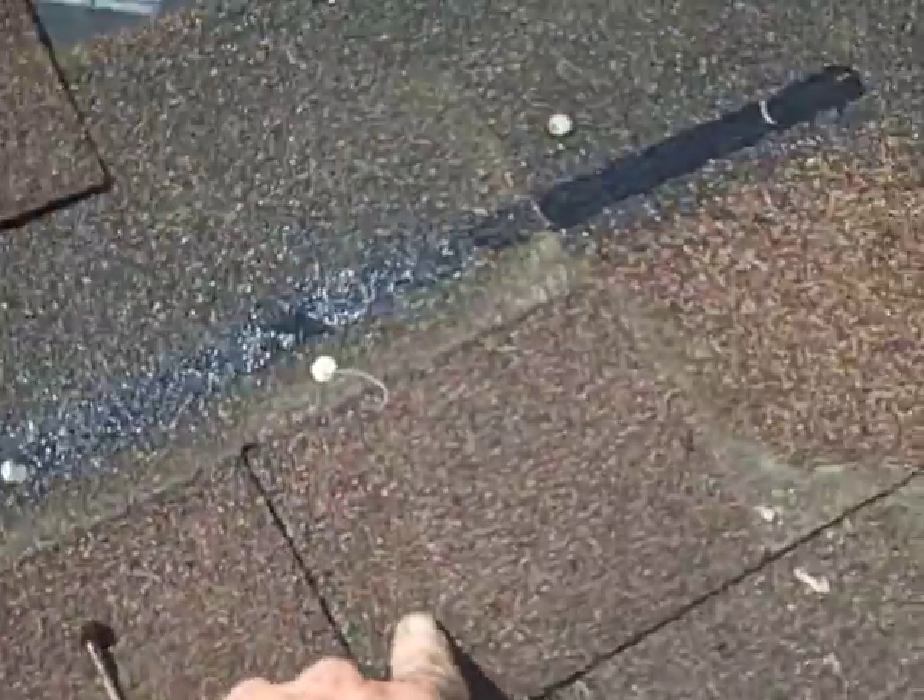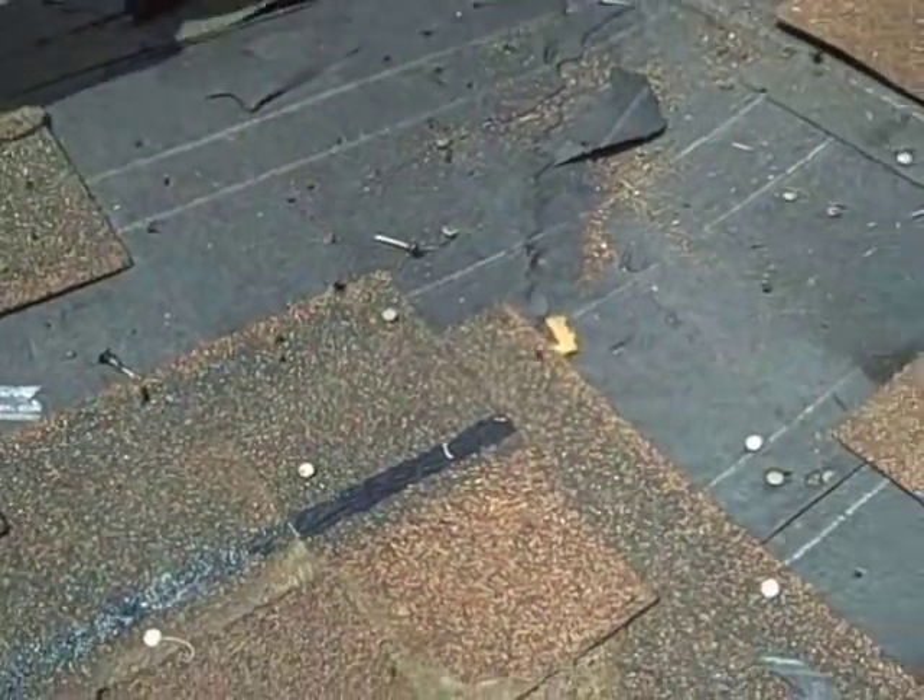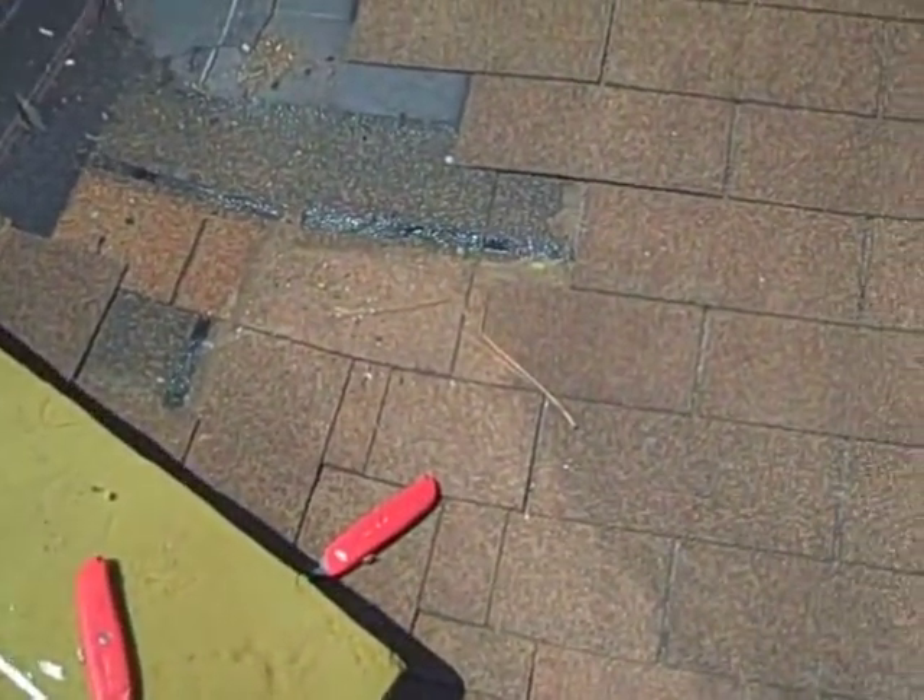Another spot — same thing. Got a three-tab shingle, they stopped it short of the top of the shingle. It goes that way, got a shingle that way. This one has to cross that top — I like to cross them a couple of inches. Any roofer knows that this is an improper way to run a valley.